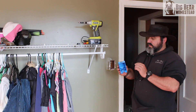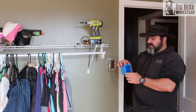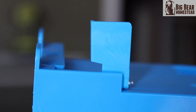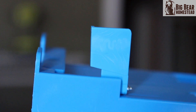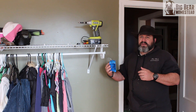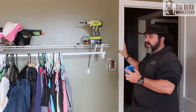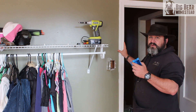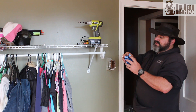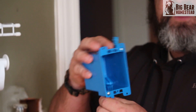The difference between this new box and the box that nails into the studs is basically these pieces right here. These boxes are specifically made for situations like this — if you're moving an outlet, adding a switch, a phone line, data line, or cable. These flaps right here grab hold of the drywall, and that's what secures the box.